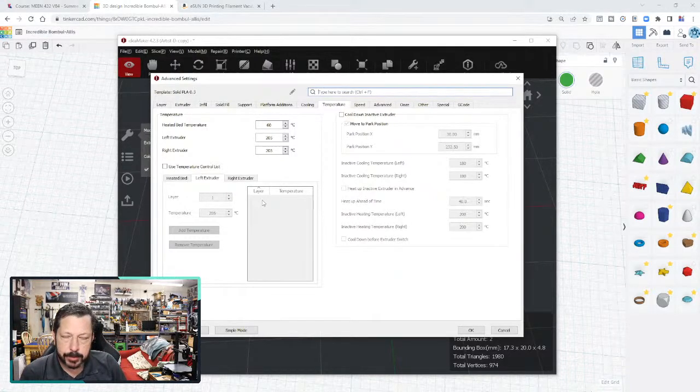That's really handy for some materials because, well, for two things. A common material, you can print a little bit hotter those first few layers to really get them to stick down. And there's other materials where you can vary the temperature, and the hotter and cooler temperature layers will actually show up in the print. So wood filaments are like that a lot of times, the ones that actually have wood fiber in them. It'll look kind of like banding in the wood grain. Some of the silks are that way. They get more matte and more shiny at different temperatures. PETG is even like that.